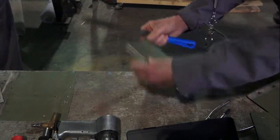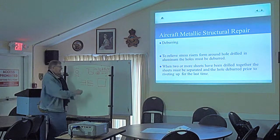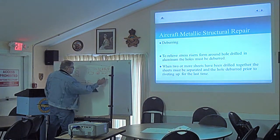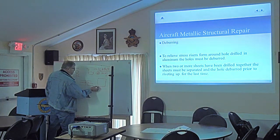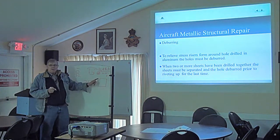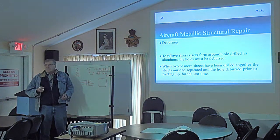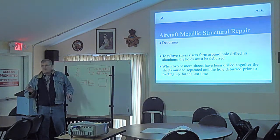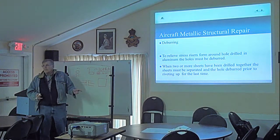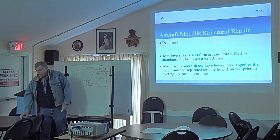What we're going to do with radius corners is look at a piece of material — we'll say it's perfectly square — and we need to radius this corner, this corner, this corner, and this corner. We want to take off about between a sixteenth and an eighth of an inch, then take our file, round it out, and do both sides of the skin. By removing that sharp corner, we get rid of the stress risers. As I said in the first video: once that aircraft fires up, it vibrates continuously. As it climbs altitude it expands, and contracts as it comes down; it expands and contracts with heat and cold temperature changes. This all has a huge bearing on these skins, which is why we have to be so careful in de-riveting, re-riveting, and making new skins.